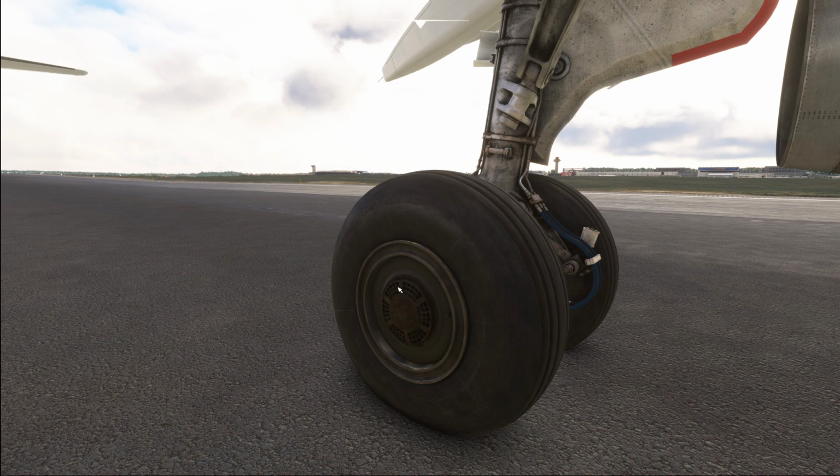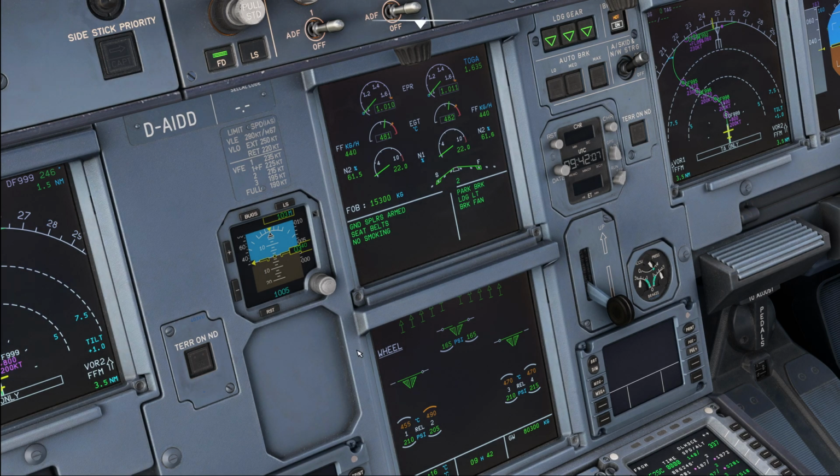By the way, did you notice that you can actually see the fan moving down there? Now that's pretty nice, isn't it? So, the temperature already starts to cool. However, in order to demonstrate this, let me just turn the brake fan right back off again, and let's monitor what the brake temperature is going to do. There is a fairly good chance that once the initial cooling effects are over, the temperature is going to start increasing once again. So remember that when you are using your brake fans.